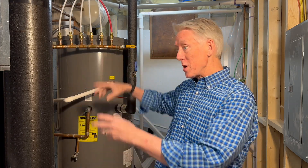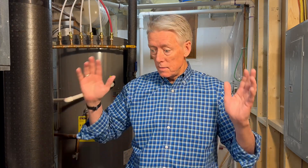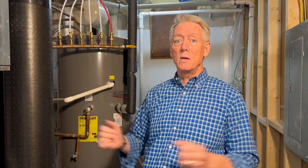It's been three days since I had my accidental fountain. I checked the anode rod — it shows evidence of pitting, so there's definitely some depletion happening, but there is plenty of material left on that rod. It's been 5.7 years, nearly six years since I got this thing going, and there's still a lot of material left. I can probably leave it for another four years at least, then check again, and maybe another four years after that. We have good water here in DeKalb County, Georgia, and water quality is one of the main factors in determining how often the anode rod will need to be replaced. I'm still on my first rod almost six years in, and I plan to make sure there will always be a functioning anode rod in there.